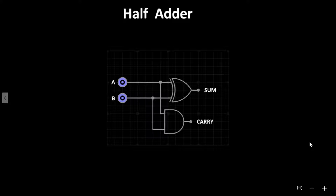We can use this circuit to add the binary value of A and B and we will see the results at the output. A and B will have the binary value of either 0 or 1. We can program the circuit to calculate 0 plus 0, 1 plus 0, 0 plus 1, and 1 plus 1. The half adder will output binary values for 0, 1, and 2.